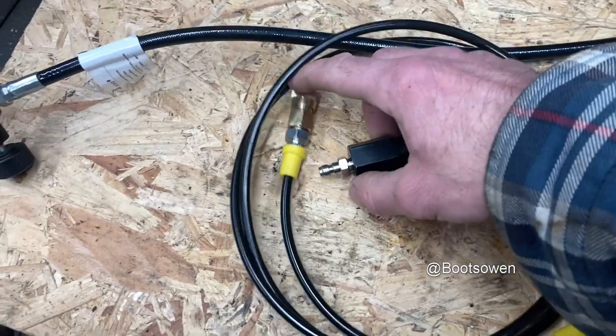Unscrewing this — you have to push it in and unscrew it, but once it starts it's quite easy. This little brass plug: if I leave the guts inside and just take the plug, as long as I don't go below the step in there, I'll be okay. I need to clamp this carefully and drill it out with an 8mm bit without gnawing up the threads, then put two little dashes across the top with a hacksaw so I can get a big flat screwdriver in to tighten it again. The easiest way to hold it is to put it back into the unit it came out of, with the pin removed so I don't damage it.